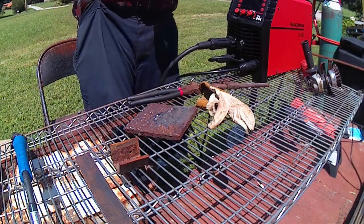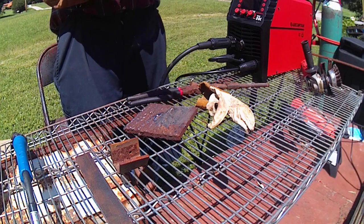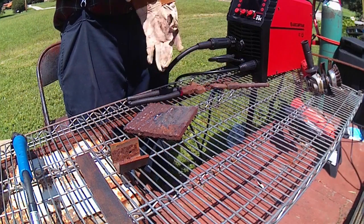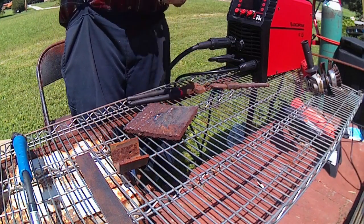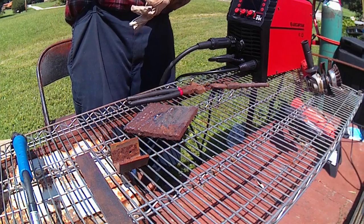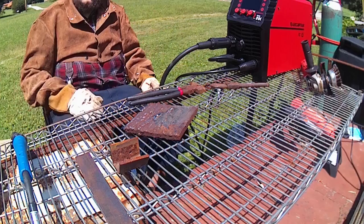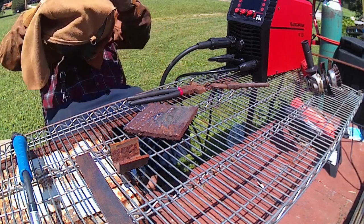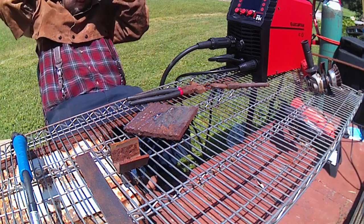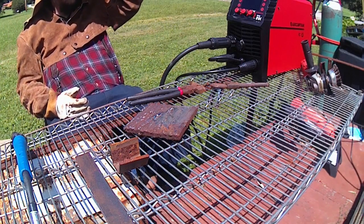Alrighty guys, so I flipped around the wire. We'll see what happens. It could just be the tension for the wire holder is a little off or something like that needs fiddled with, because it runs smooth and then it jerks and bounces the spool. So it could just be something tension-wise inside or something funky like that. So let's try welding with it. We're gonna hop off of the Synergic and then just kind of tinker with it a little bit regularly and go from there.